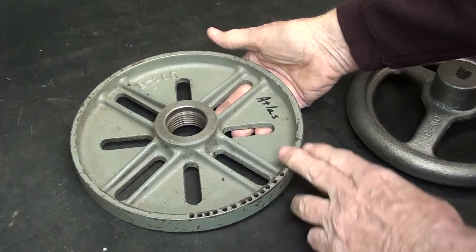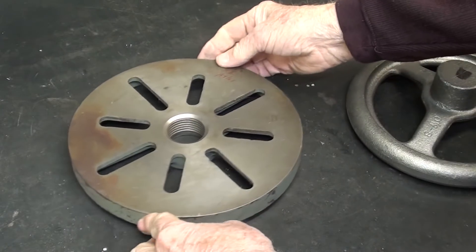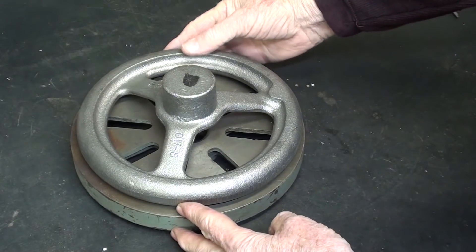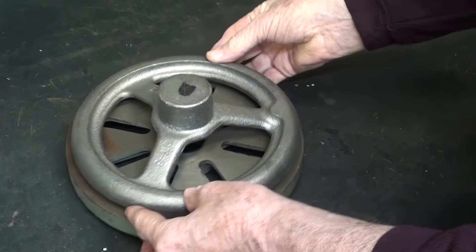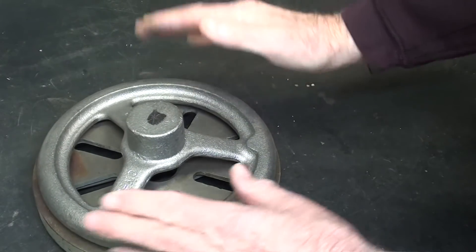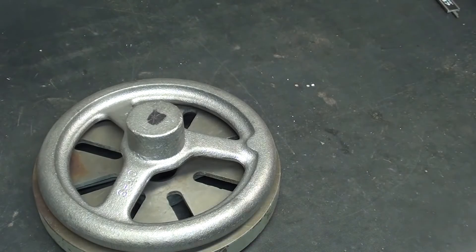This is an eight-and-a-half-inch faceplate off of my Atlas lathe, and since this wheel is eight inches, it could be clamped on there and would run pretty true. But it would be a difficult setup — it would have to be indicated on the lathe side to side — though I think this would be a pretty good method. But I have one more idea.